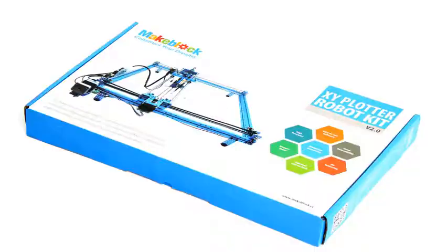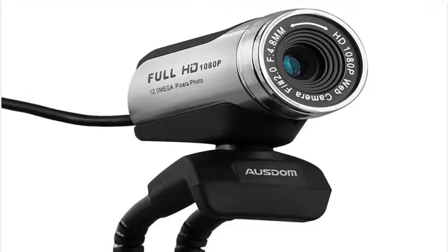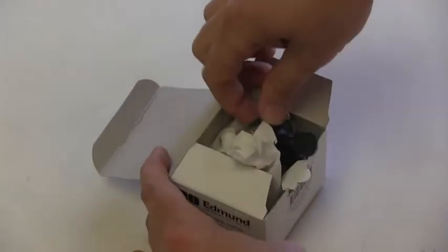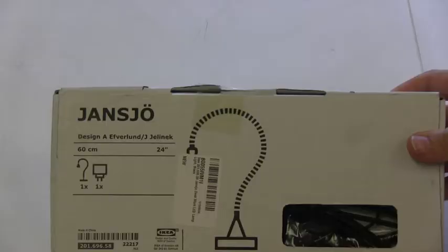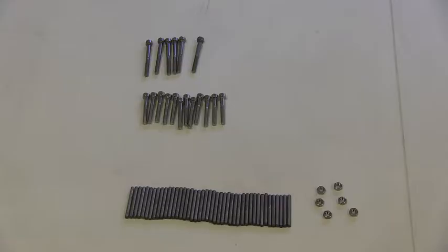The system comes configured for 12-well plates, and the robot can perform 144 lifespan experiments simultaneously. The primary components of the robotic system are an XY plotter robotics kit from the company MakeBlock, a custom-drilled acrylic sheet that serves as a light table, which can be purchased online from FrontPanelExpress.com using our provided templates, and either an inexpensive HD webcam or a more expensive monochrome board camera and lens, an IKEA LED desk lamp, and several additional MakeBlock parts to construct the transillumination arm and the table legs. All of these components can be purchased online for about $600 US.